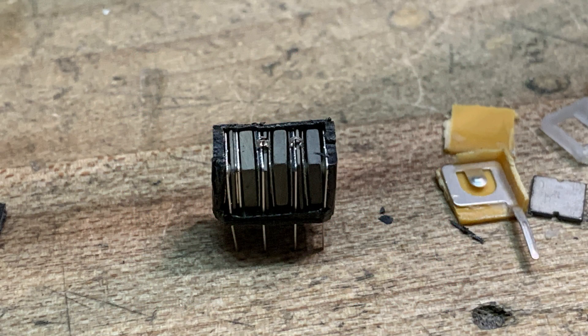If you peel off the sides, you see the exact same construction: metal contacts with slabs of metallized ceramic slid in. This one has three resonators, and sandwiched in between are capacitors. So it's: crystal, capacitor, ground — crystal, capacitor, ground — crystal, capacitor, ground. That's why it has three ground legs, with the other two being input and output.